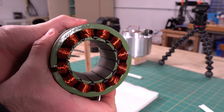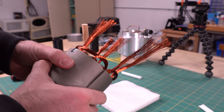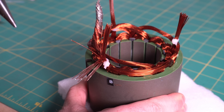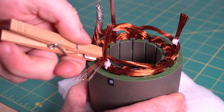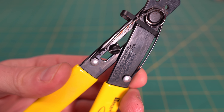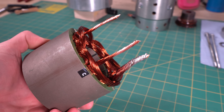Once the winding was complete, I made wedges by cutting thin strips of micarta on my table saw. The wedges help ensure that the windings stay in place. Next I cut the windings to the appropriate length and began the tedious task of removing the enamel coating. I started by using needle nose pliers to scrape off most of the coating, then went over it with sandpaper glued to a clothespin. I eventually came up with a faster solution using wire cutters with a screw on the side that allowed me to set the maximum cutting diameter, making it easy to scrape off the enamel. Finally, I could solder on the leads.